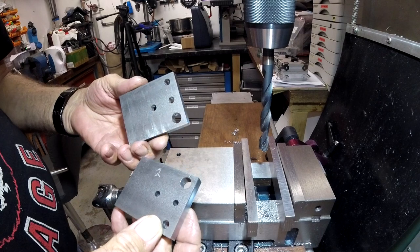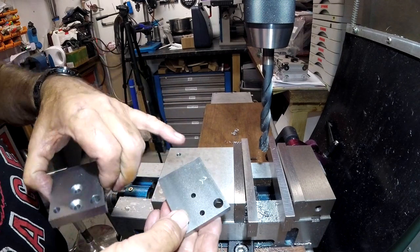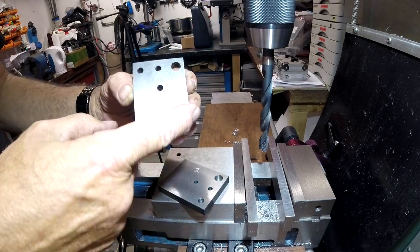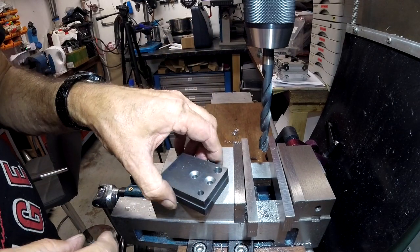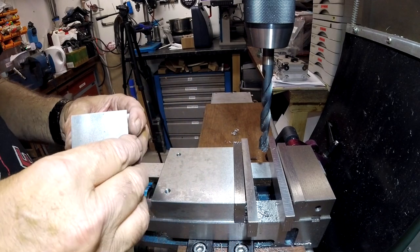They're going to want to be back to back somehow, because I've got a miller slot. Let's get this right. A 3/4 inch slot down there, 3/16 deep, and one down there. So the two slots match. So if I'm going to bolt them together,